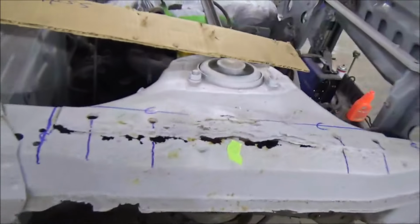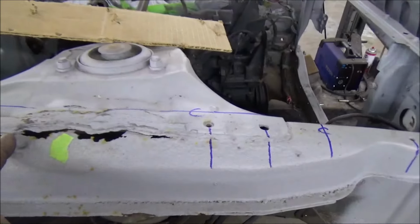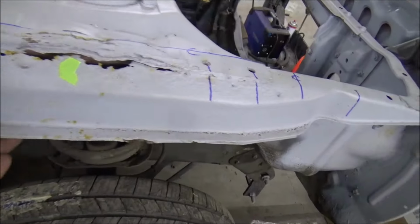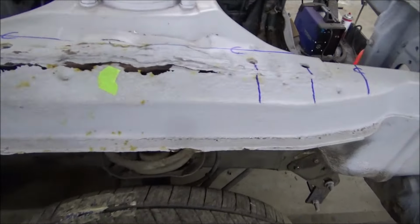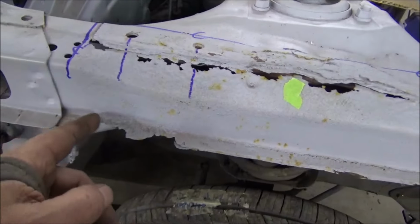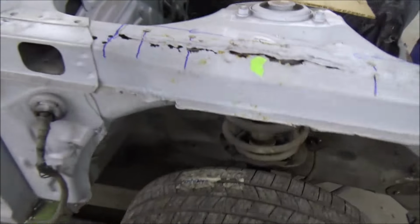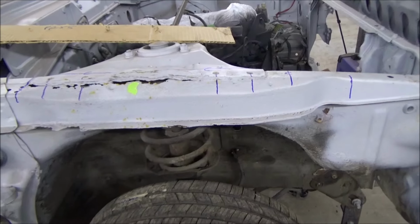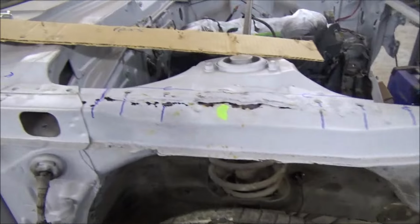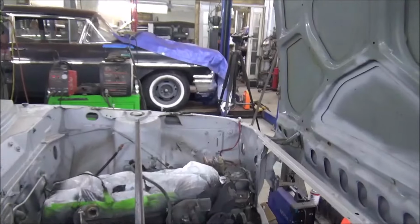Now, on this side here, of course, it's the same thing. Cut, cut, cut. Do just like I did the other side. Under here is good. It's just this lip right here. So I'm probably going to come in here and just chop up some of this lip and just put a new lip in there. Like I say, the fender's going to cover it. It's not a show car, so that'll be just fine once everything's together. But I just feel like that lip ought to be cut out and repaired. You know what I'm saying? But yeah, I'll come out here and get busy with it again